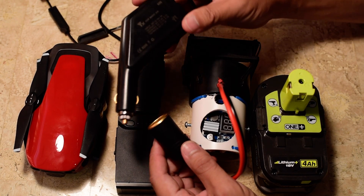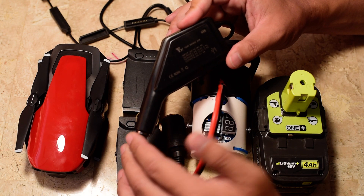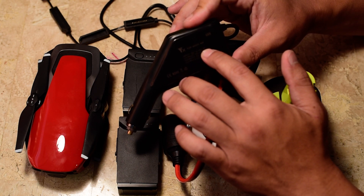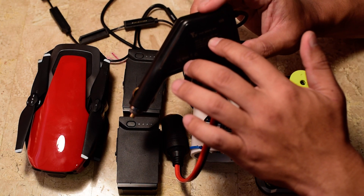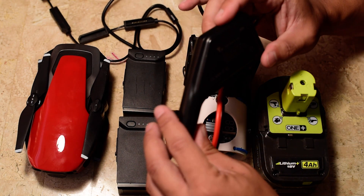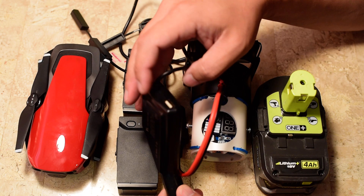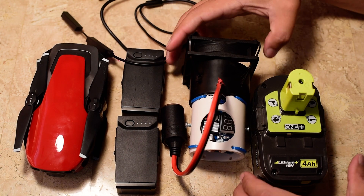What plugs into that is this car charger for the Mavic Air batteries. This car charger has an input voltage of DC — direct current — 12 to 16 volts, up to 6 amps. Setting the output at 14 volts is right in the middle of that range, and it works. It outputs at 13.2 volts and 2.1 amps, twice, because there are two battery terminals. It also has a USB adapter so you can charge any USB device, like a phone.